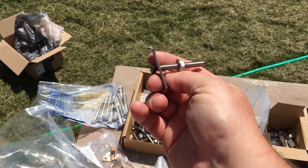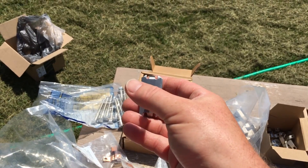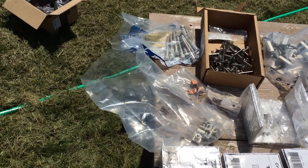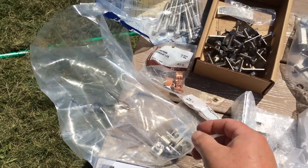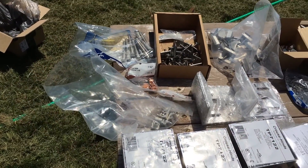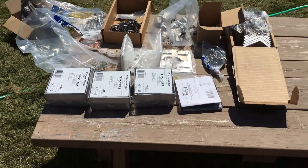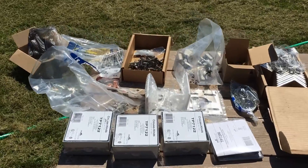What's cool is you don't have to use weeb connectors — it's kind of built in. I've got my stainless steel lugs, three and a half inch three-eighths. I also have terminals I'm going to put in the junction boxes because I have number six grounding wire and smaller wires, and I need to make sure everything is properly connected. I have the legs for the solar panels in the garage — lots of connections and things to think about before you just throw some solar panels up on the ground.